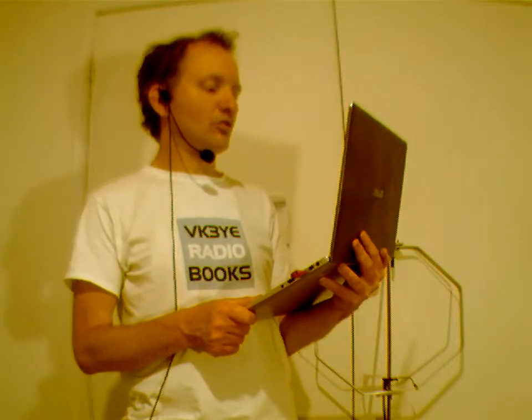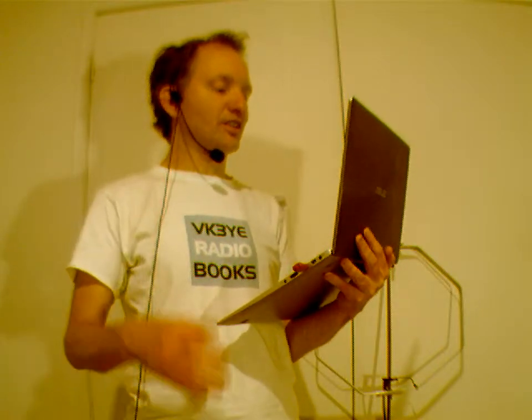And there's another mode, I think it's JT6M or similar. Anyway, I forgot what it was called, but I did a video of it where it's basically optimized for meteor scatter. So I just had my HF antenna connected on 6 meters, and I knew there was a meteor scatter session going around 6 a.m. in the morning. So I left the rig on, and I decoded signals from VK4, like that's 1,000 or 1,500 kilometers away. So yep, there are some great digital modes for VHF.